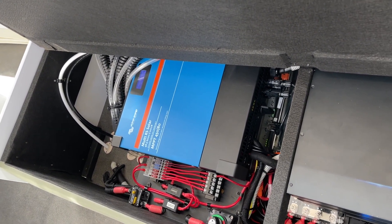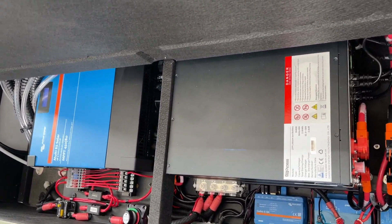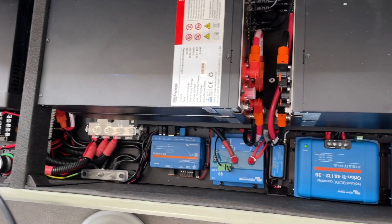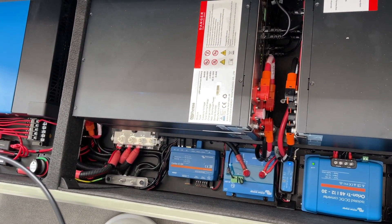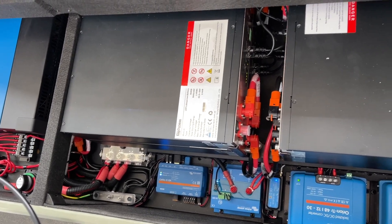They've pulled the plumbing out over one end. Up there is the 6000-watt inverter. We've got five batteries in here, so this has actually got a thousand amp hours of 12-volt equivalent. The breakers and fuses are all down the side, and then we've got our other gear — what we call the fruit — on the bottom. You can see that huge link on the batteries and the negatives there.